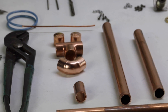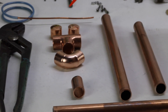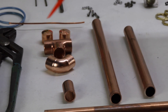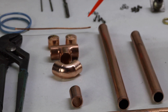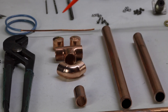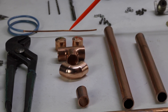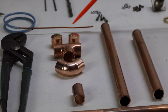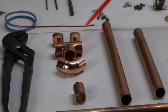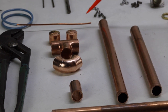Now the parts used to make the J-pole antennas. We start with 12 gauge solid wire — you don't need more than a couple of inches, but strip it and make sure it's nice and shiny; that's where the steel wool comes in. You'll use about an inch to an inch and a half to make the tuning section. Even for a two meter or six meter J-pole, you don't need very much copper wire.